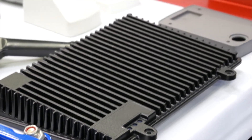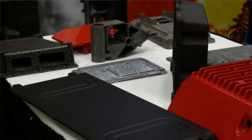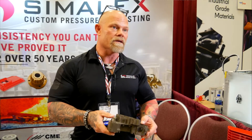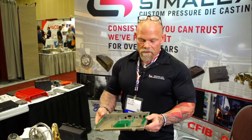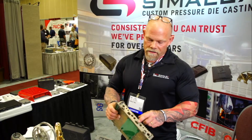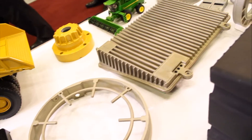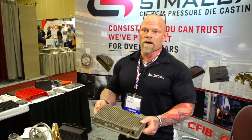Design for manufacturing is something that Simulex specializes in. We have 52 years in business — I'm third generation — and our expertise goes beyond what most casters can even offer. In a die casting world, we can make one of these every minute. If you were to machine this out of billet material, it would be quite expensive. You can see all these different connector holes that you'd have to machine in, plus all these ribs. There are a lot of features that need to be added to this block of aluminum.